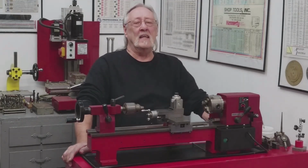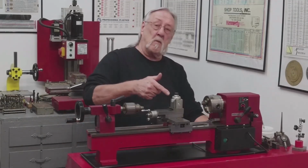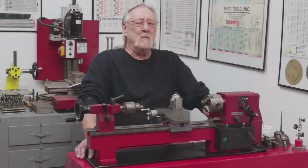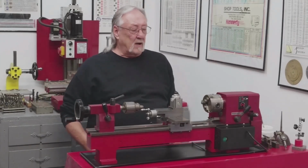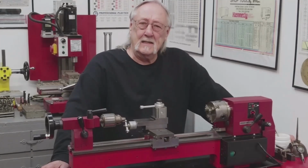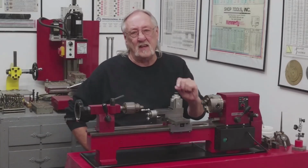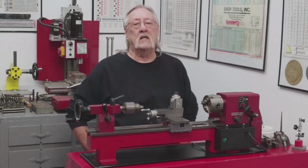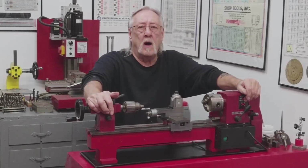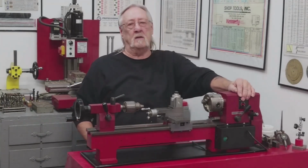Today I thought we'd get into some fast and dirty lathe work, and I thought we'd do it on my mini lathe. Let's get into that. What I mean by fast and dirty is there's really no tolerances. Let's just get it done. I need to make 4 heavy-duty washers about an 1/8 inch thick. And I need to cut off some threaded rod. This stuff is for my Burke number 22 drill press. Let me show you what I mean.